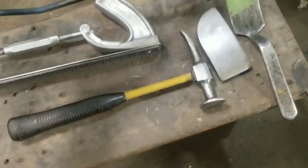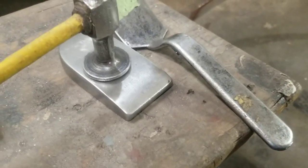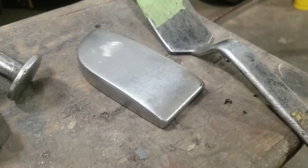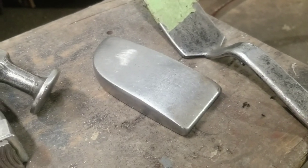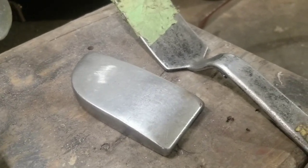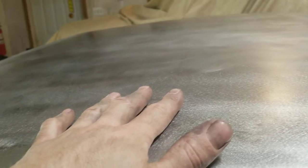So what I was doing when I was welding this is I'd weld a couple inch section at a time, and then I would use the hammer on dolly technique or the slapper to planish the welds, which stretches them back into shape. Every time something is welded, it shrinks slightly, so I found that just kind of helped to keep the distortion under control, because every time I welded it would pucker a pretty big section of roof, and all I did was hammer on dolly in that area and it would bring the whole thing back up.